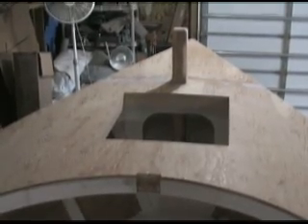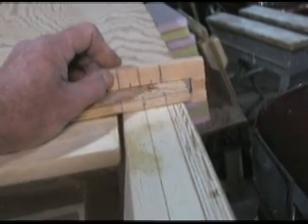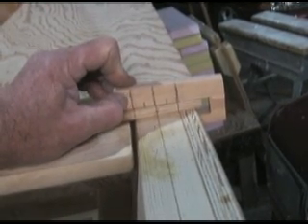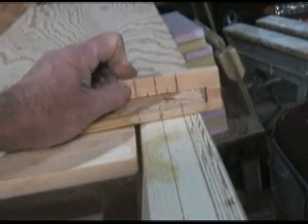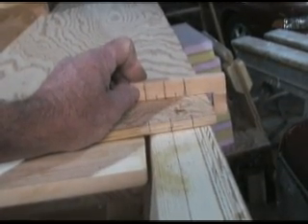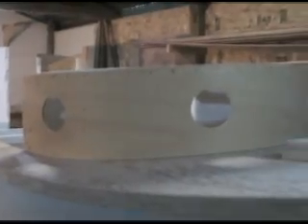It's October 5th now. I did get my foredeck installed — got this all ground down and ground over nicely. I made this little tool so I can locate where the laminations of the shear clamp are and mark for the screw hole, so the alternating screws will go into one lamination and then alternate inside and outside lamination. Foam pieces are all in now. Side decks are on, even got the roundhouse on — got lucky with the weather. Even got the beam in and the hatch framing. Cut the stern bit in.